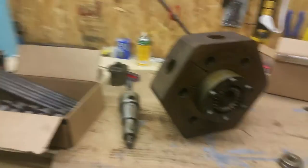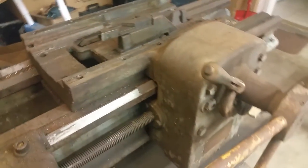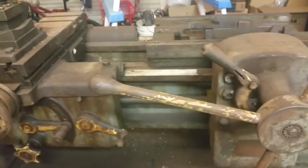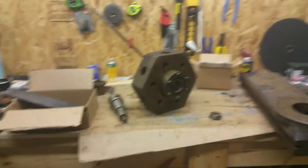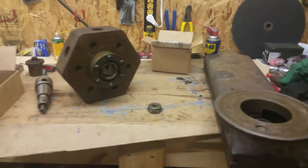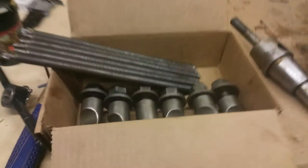Between needing to align this bore and the shaft coming down into here, it was just a real bear getting it up, but we got it apart. As I go I'm probably going to be changing plans. My initial plan was to strip this whole assembly — I still may do that — but I'm undecided because of the lead screw. I'm kind of figuring this out as I go. I don't know if I've got to rip down both aprons and the quick gear change box to get it out, or if there are other ways to work around that. I think I'm going to build each component — clean and build it — so I don't end up with a million parts and lose track.